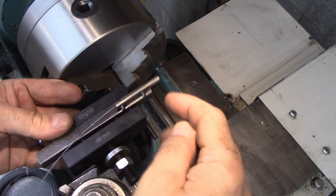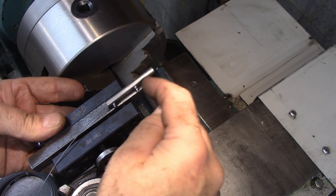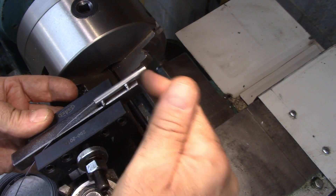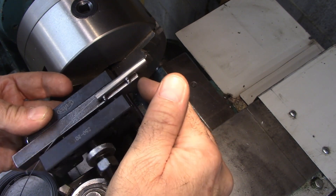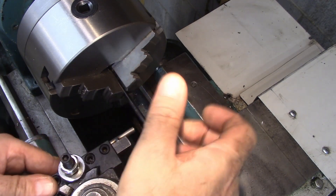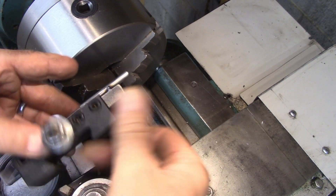I've got this spring winding device that I made — I have a separate video on how I made it. It's pretty easy. It's just a piece of stainless steel brake line and some half-inch steel that I put in a holder here, but it gets it nice and close to your mandrel. You can see the music wire loaded up in there.